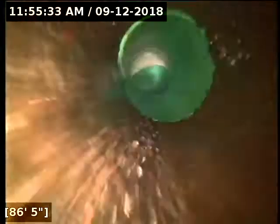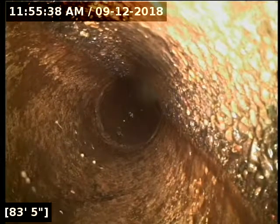Alrighty, we're about 4 feet, 5 feet back from the sidewalk with a white X on the ground. I'm hitting the depth there right around 6.5, 7 feet deep. It's kind of an awkward spot to locate because, again, there's a bunch of bushes there. This guy here, I'm pretty sure is going to be smacked out under some bushes. We're going to pull it back just a little bit further than this and try and locate it. Alright, we are clear from the bushes here. Let's put a big white arrow on the ground. We're about 4 feet 6 inches deep.